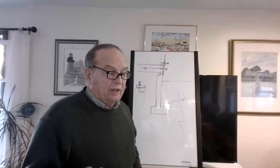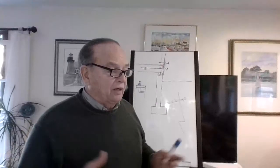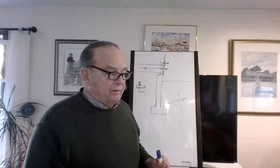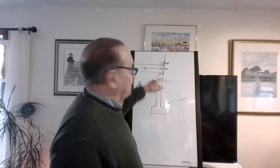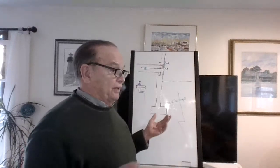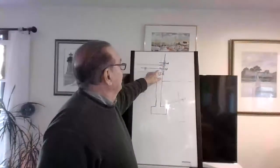And if you really want to be safe, invest in a pilot bit. It's about the size of the 1/4 inch bit in the center of a hole saw. The name escapes me, but get a feeler bit from an electrical supply place. They got good ones. They're very flexible, very sharp, and they're only about 1/4 inch diameter. You don't get too big a one. You want a small one. So if you screw up, that's the idea of using it. When you pop out, the hole that you make isn't too big, right? You don't want to go and blast in there with a 1-inch bit and find out it's wrong. So if you're not sure, put a feeler in first. You like that? Okay, fine.